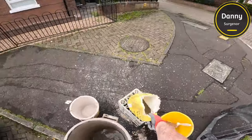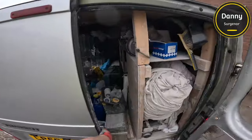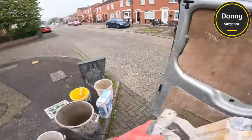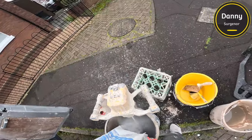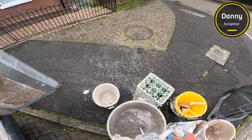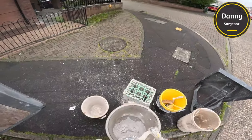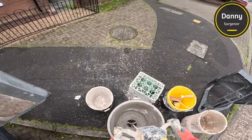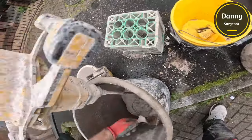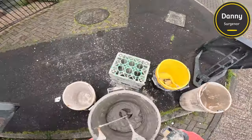The two yellow buckets are always kept clean because we use them just for water. I put one bucket of water into the black bucket and the other into the white bucket. I'm going to put four handfuls of cement in and then a bag of skim. One of these yellow buckets usually mixes a bag of skim for me — it makes it just a little bit tight, which is exactly what I want for filling out that big gap where the plasterboard is.